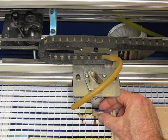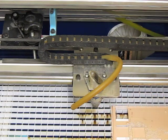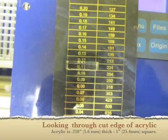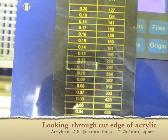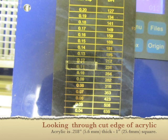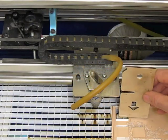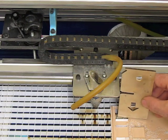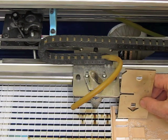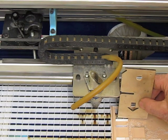It does a beautiful job of cutting in three passes and automatically moves the table each time. We check the focus now — you can see that we have raised the table up by about three millimeters. That's because we raised it one millimeter after each pass.